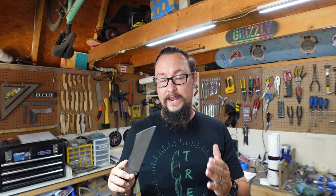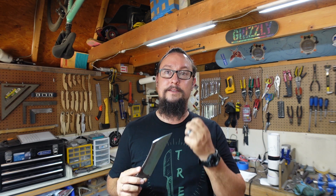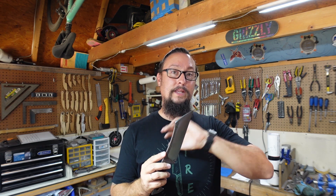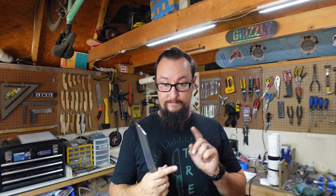Now 5160 does benefit from a little bit of a soak time. If you can keep it at that temp range for three to five minutes and then quench it, you're going to have a better hardened blade. But when it boils down to it, get this stuff hot, get it non-magnetic, go a little bit past that, and quench it in vegetable oil, canola oil — if you're brave enough, water, though I would never quench it in water. Parks 50, peanut oil — you can pretty much quench 5160 in so many different types of oils.